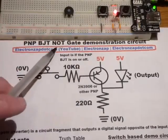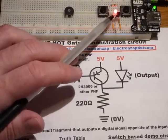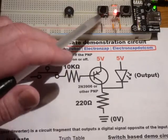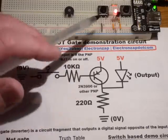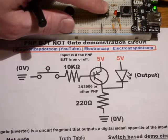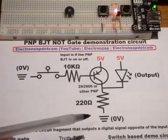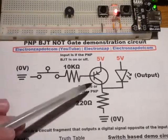In this video we're going to do a step-by-step build of this circuit. This is a NOT gate demonstration circuit. Right now the input is off and the output is on — the output is our load, the LED. The input is how we're controlling this, which is the switch, which is controlling whether the transistor turns on and off. So right now the switch and the transistor are off, the LED is on. When I close the switch, now the switch is on, the transistor is on, and the output is off — the LED is off. So that's the basic premise of this circuit. Not too complicated, but it's an unusual circuit, and you'll see similar circuits when building other circuits, so understanding this will help you.